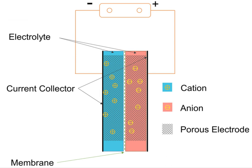Inexpensive components use open capacitor papers. More sophisticated designs use non-woven porous polymeric films like polyacrylonitrile or Kapton, woven glass fibers or porous woven ceramic fibers.